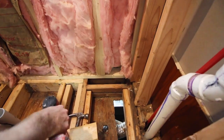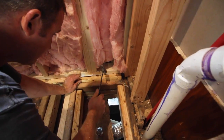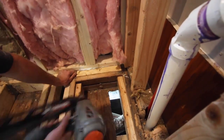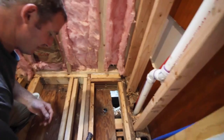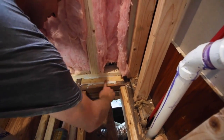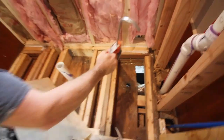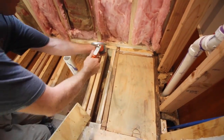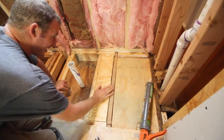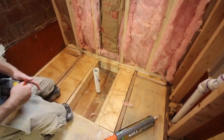The reason we're doing this is that you have to make the floor recessed — at least three-quarters of an inch below your main bathroom floor subfloor — so your curbless shower pan is almost even with the main bathroom floor, hence curbless or barrier-free. As you add these 2x4s to the joists, always use a level to make sure everything remains level. Sometimes you have a gap between your exterior wall and framing — you can fill that with liquid nails on a scrap 2x4, secure it with a screw, and then use 3-inch deck screws to fasten it to your exterior framing. You never want a gap between framing members.